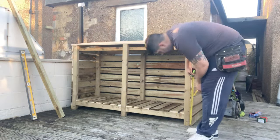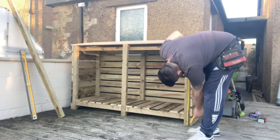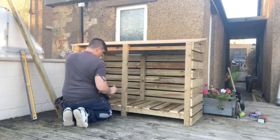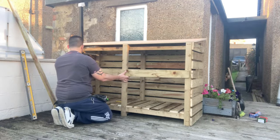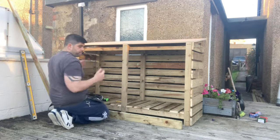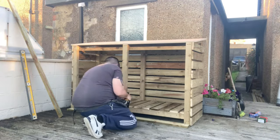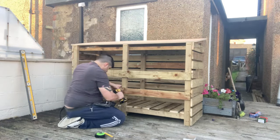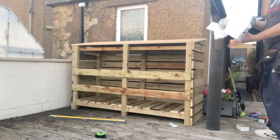The roof is on now. I'm going to add a couple more pieces of timber to the front — these are basically guard rails just to stop any of the wood falling out of the log store. There's no real set measurements here — I think it was around 700 and 400 millimeters. The 700 millimeter top one gives you plenty of room to get in and grab timber, and it won't obstruct you loading logs into the store. Again, just two screws fixing it into the upright frames — very simple.